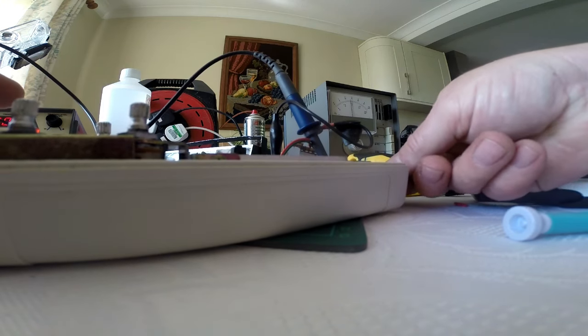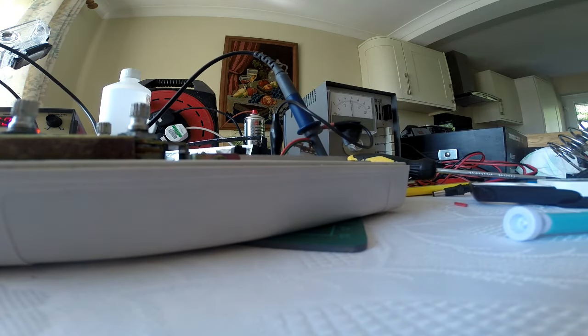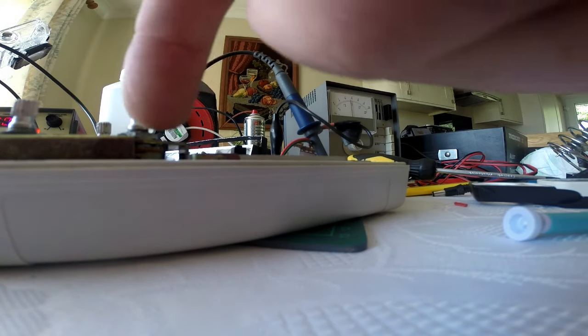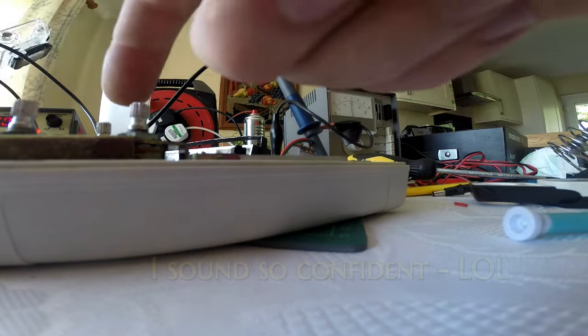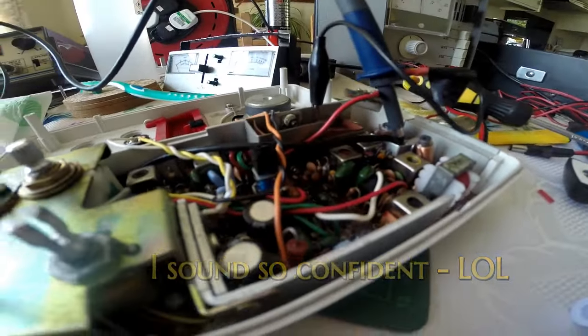And funnily enough, going after those solder joints, I don't seem to have a dodgy power connection anymore as well, so that's really good. I'm going to get inside to see if I can put some switch cleaner inside the volume, the squelch and a bit in the channel change as well. But I think we're on a bit of a winning area.